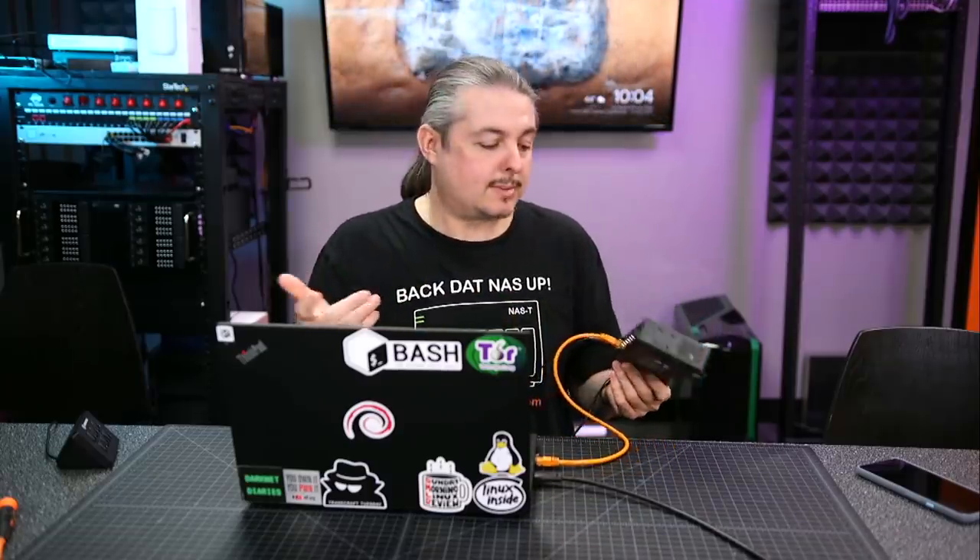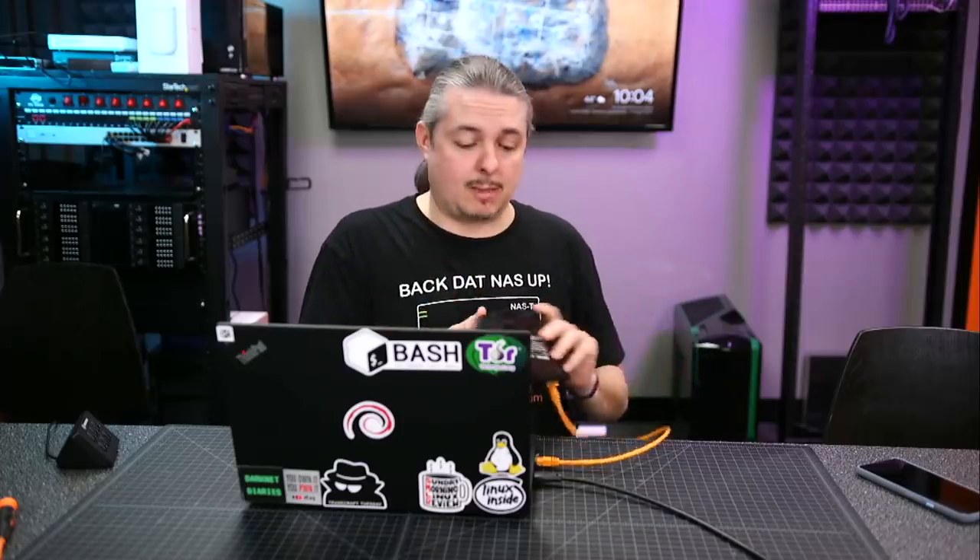This is a quick review of the Edge Switch - it's been kicking around the lab for a while. We use it to test configurations and have deployed it for some one-off jobs where we're not managing the full infrastructure and wanted something easy to log into, like managing a couple of cameras that need to be on separate VLANs. They're solid, reliable - we've never had a problem with them. They're less recommended for home users due to the VLAN tagging complexity, though you can configure all of that from the command line as well - so it is a great tool to learn on. But for people who just want it to work and need something easy, I still push them to the UniFi line, which is why it's so popular. But it's not a bad switch at all - I do recommend it.